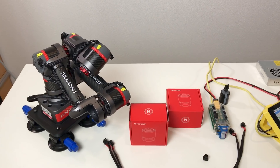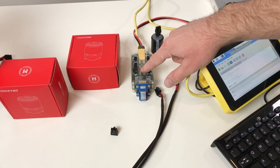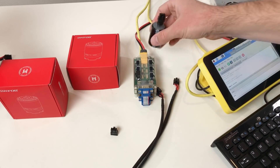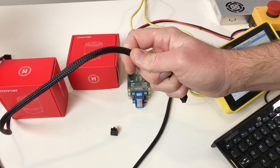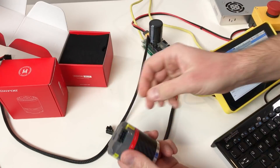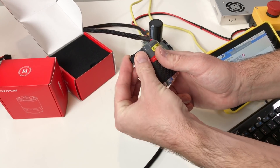By the way, this is the robot from my last video. The connection is super simple. Here you have CAN bus 1 and CAN bus 2 — you can use either of them. On each CAN bus you have three connectors: one for the termination resistor, one for the capacitor, and one for the actuator. So let's take one cable and put it here, then take one of our actuators and the other side of this cable goes into the actuator.